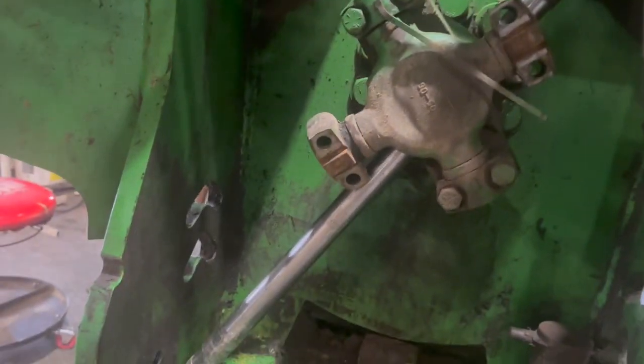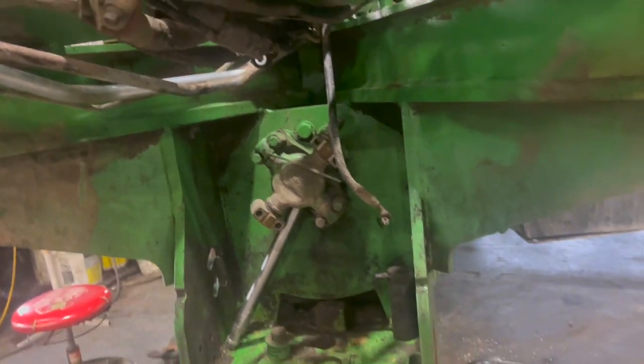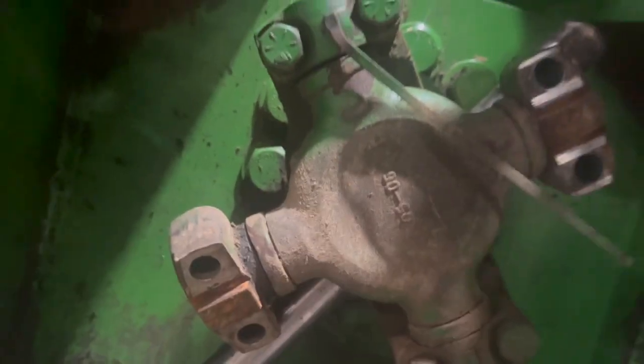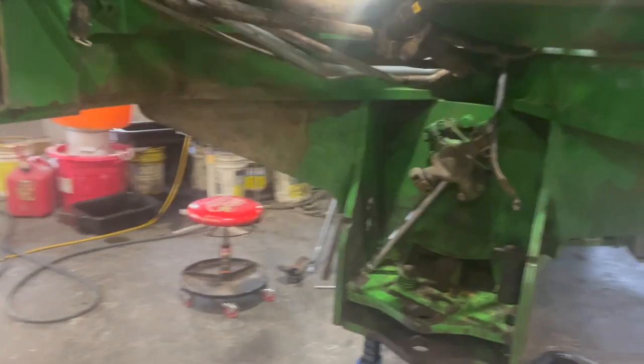It slides straight up the middle. I have a crossbar in there so I can loosen that front nut — that didn't work too bad. But in doing this I realized that this U-joint is definitely out, so that could be the vibration that they were having to knock that front bearing out. I don't know for sure yet.